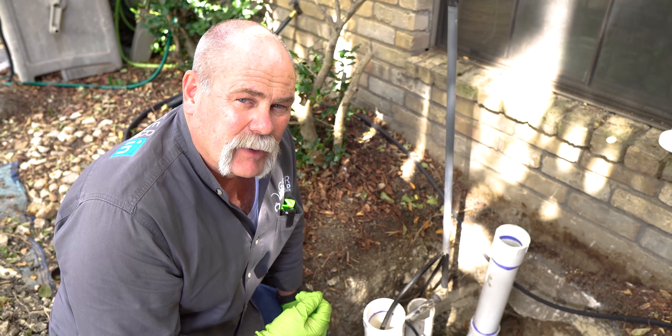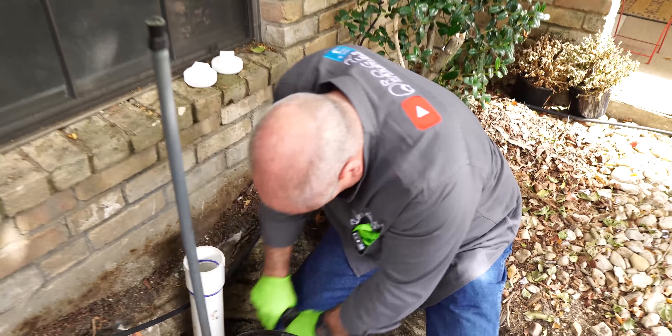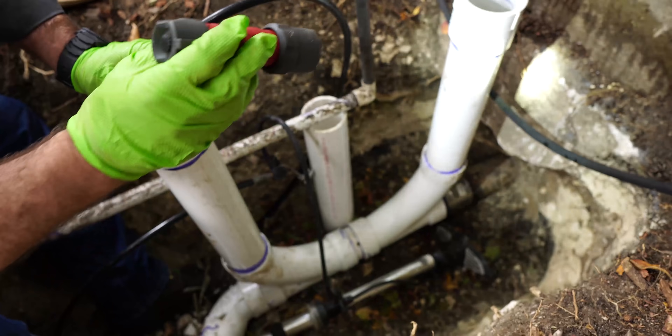What kind of plumber do you want to be? This lady has had two plumbers come over, both owned by that same umbrella company. The first plumber came over, ran a camera only, and said your sewer is shot — it all needs to be replaced. If you take money out of your retirement and borrow money and come up with about $60,000, we can fix it. We just did a water test. Don't ever trust a camera alone. The lady told me there's a guy on Nextdoor who says cameras don't lie. Well, they don't lie, but they don't always tell the truth because they can't see the truth.